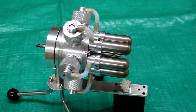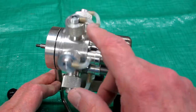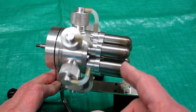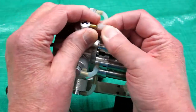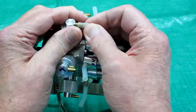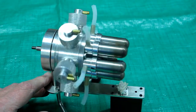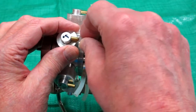I had a friend come over. I was going to demonstrate the Gatling Stirling to him and I could not get this thing to start. I was quite surprised by that. If I spin this, I can hear some of these displacers going back and forth. If I disconnect all of these tubes, then obviously nothing's moving. So I'm starting off with an X on this one cylinder.